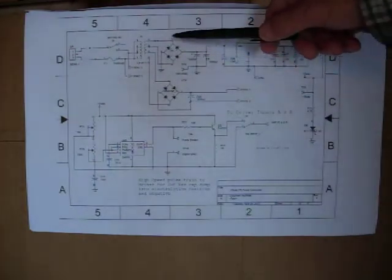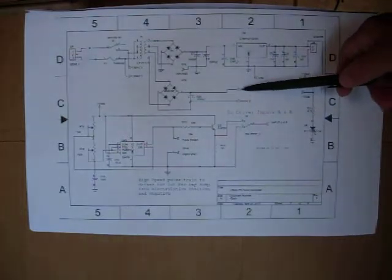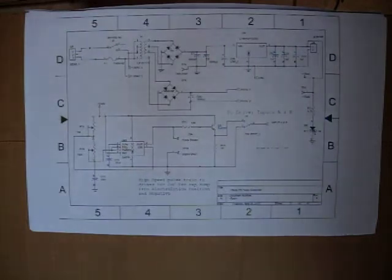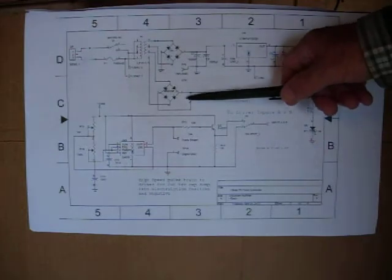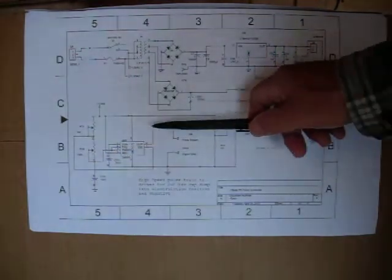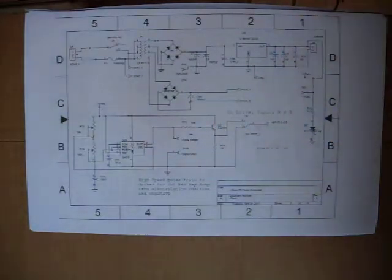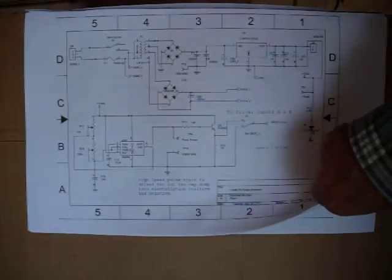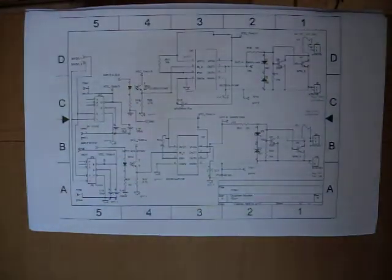This page here is the power supply. It's plus 15 volts for the digital circuitry, and I'm putting out some DC plus and minus 30 to go out to the extra boards to drive stators 2, 3, and 4. Here I forgot the NE556 timer. It puts out the input A and B clock, for whenever I need clock on the board.